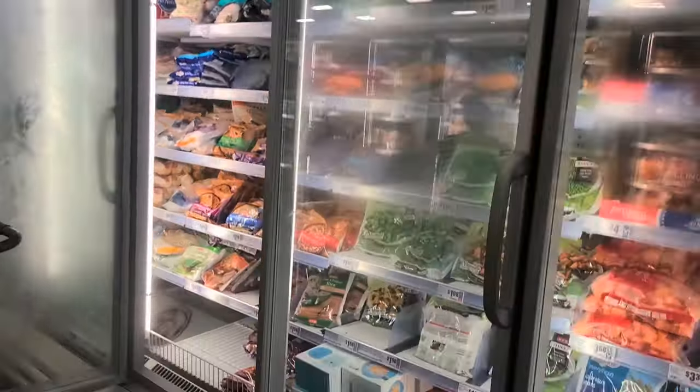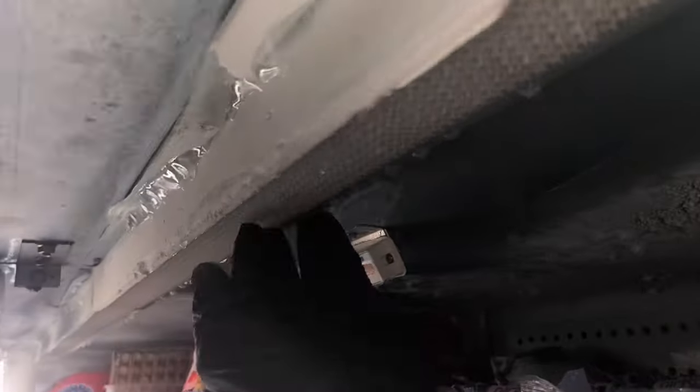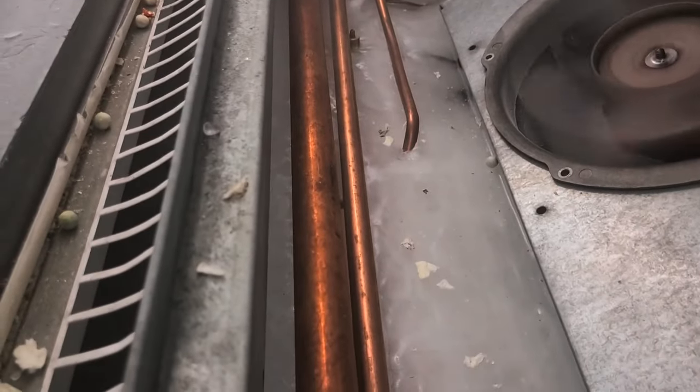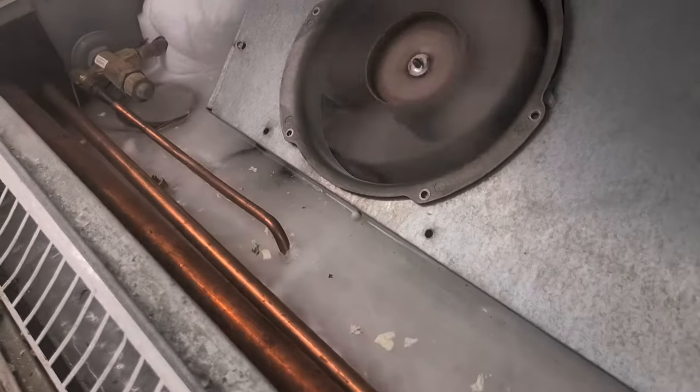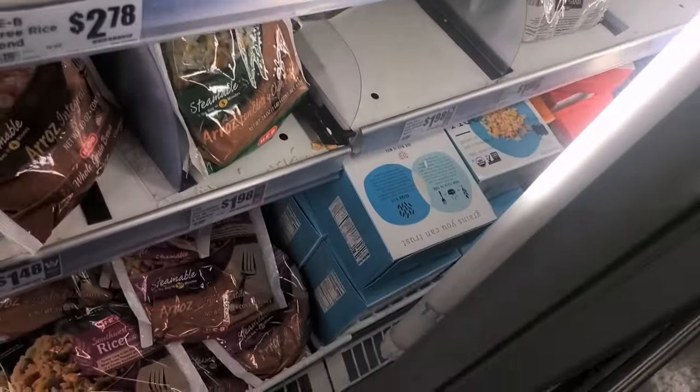Here I've got a four-door case and you can see water up here. Everything is soft. Got a plugged drain that's caused water to build up, ice to build up. Got to melt it, clear the drain and that's probably it.